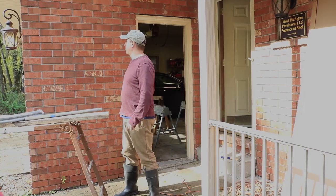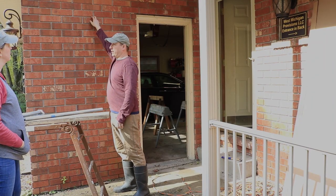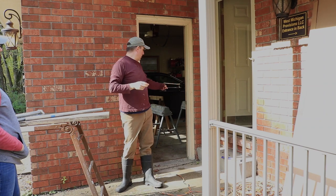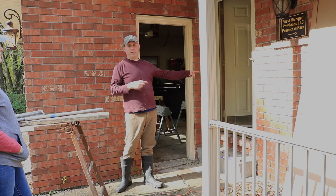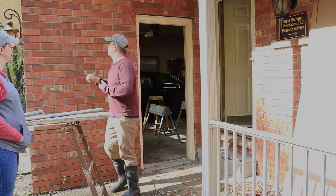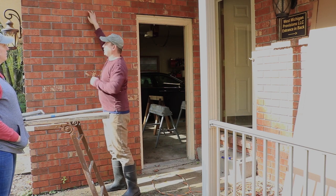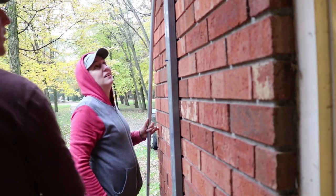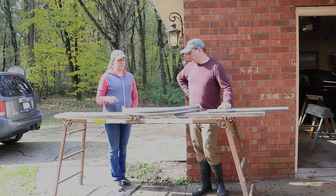We have a classic storm door that is 80 or 81 inches — that's the opening height, right about here by our measurement. Our stud will come just slightly above that. The door is 36 inches wide; this door opening might be 28 or 30 inches across, but we don't want to restrict our ability to move things in, so we got the 36-inch — it's the same price. Our arch needs to intersect at that connection point where we're comfortable, and we'll line up the door and screw in the first stud there.